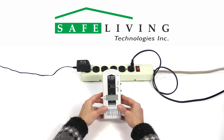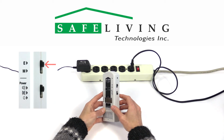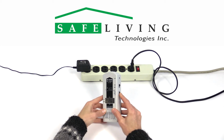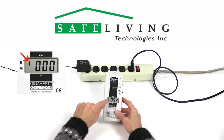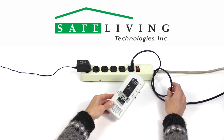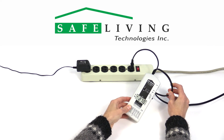To measure AC electric fields, set the field type switch to E, set the frequency range to 50 Hz to 100 kHz, and power the unit on with the sound option. Note the indicator on the display next to the E showing that you are in electric mode. Slowly scan an area and follow the direction of the highest field strength. The Geiger counter tone will also increase closer to the source.